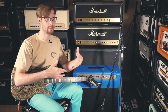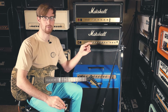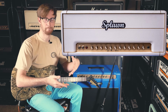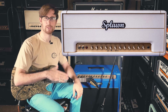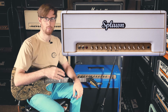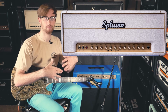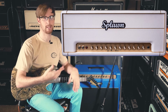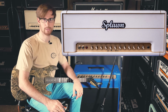Then I have one from 2008, but I think maybe the changeover was sometime around 2007. There's a third version of the Quick Rod where the lead channel is voiced a lot darker and a lot more smooth and refined sounding, plus a fourth preamp tube, which is used exclusively on the clean channel. Those have an actual, true, very clean channel, although there's a gain control on it, so you can get a little bit of grit, but it's much more usable.